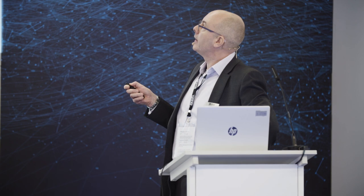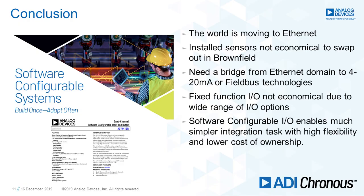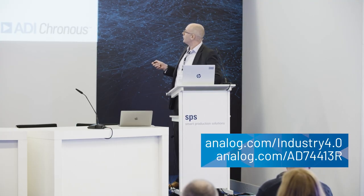Wrapping up: the world is moving to Ethernet, and it's moving there very quickly. Installed sensors — it's not economical to swap those out, so we need a solution for brownfield. We need to bridge from Ethernet to the legacy 4 to 20 milliamp, which is going to be here for the next 20 to 30 years. Fixed function I/O is not economical and doesn't give you the best performance in terms of cost. By using software configurable I/O, we have the flexibility to give you exactly the I/O mix you want in any installation.